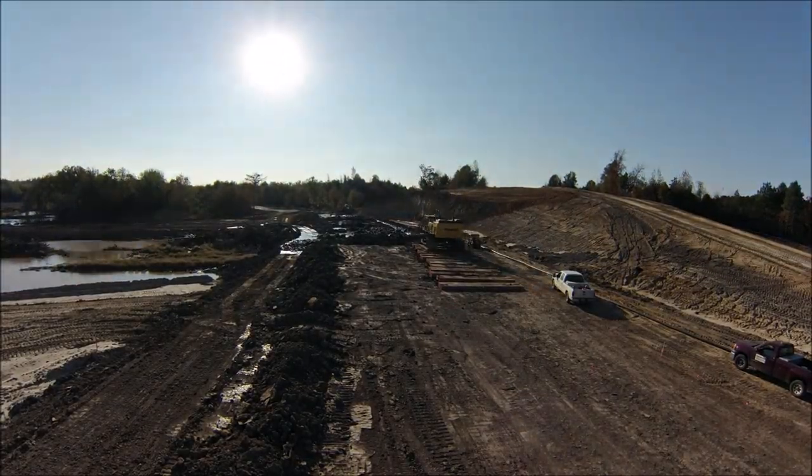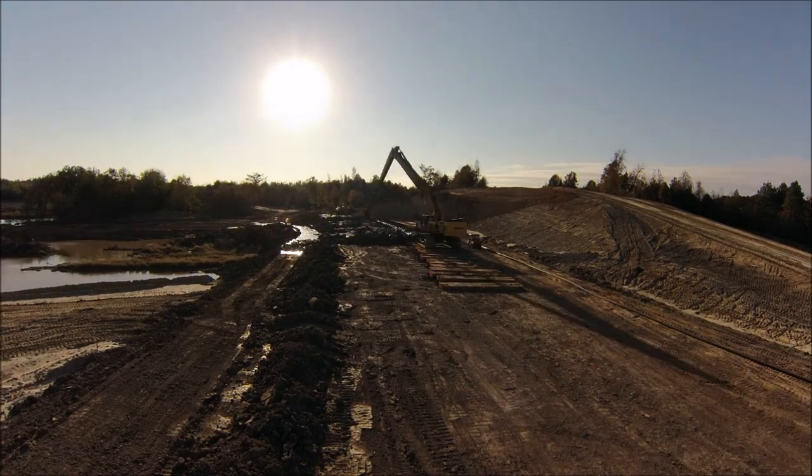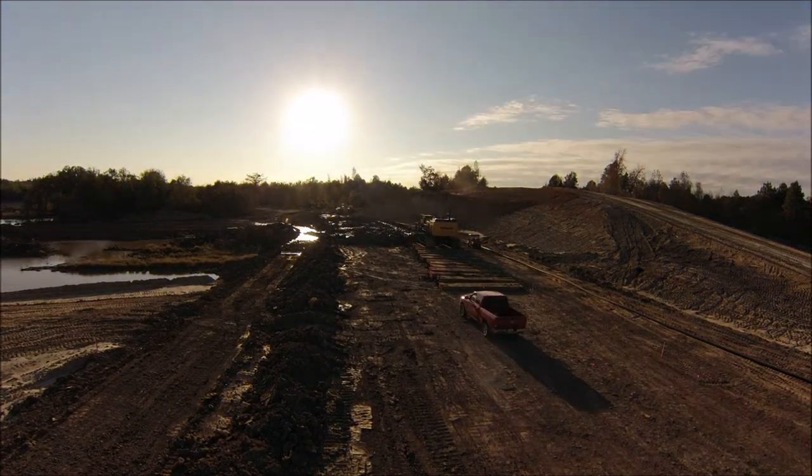And then finally, overall sequencing here in time-lapse. The excavator is simply going to work backwards, keeping the trench open with slurry, and then on the very far end, the backfill is being placed.